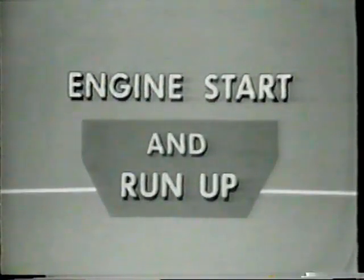Now we are ready for engine start and run up. Let us review some precautionary measures, limitations, and procedures prior to starting. Keep in mind the maximum wind limitations for starting and stopping the OH-58A Kiowa is 45 knots. Caution: in case of false start or start not completed in a total time of 45 seconds, close throttle and motor engine with throttle closed for at least 10 seconds, and until residual TOT indication reads less than 200 degrees centigrade. At outside air temperature of 10 degrees centigrade or below, allowable total starting time is increased to 60 seconds. If starter relay chatters during start cycle, it is an indication of low battery power — abort start and use APU or recharge battery.